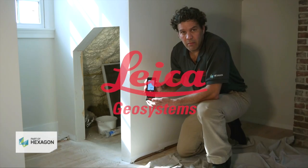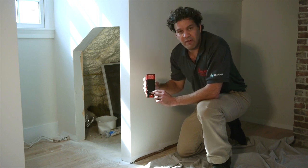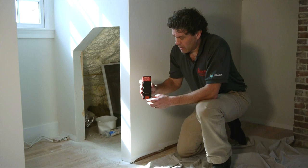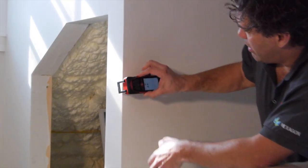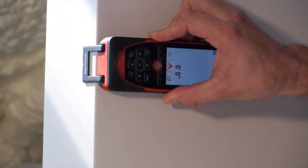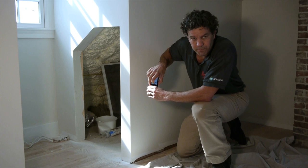The other way to set the reference point for your measurements is to use the intelligent end piece on the back of the unit. Just make sure that you haven't left it in a locked-out mode for tripod or FTA. Flip it out to 90 degrees — that tells the Disto to shoot from the back. You can then hook it onto a corner so that you know you're getting your measurement accurately straight from the back of the unit. Take your shot and you're good to go.